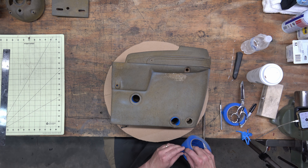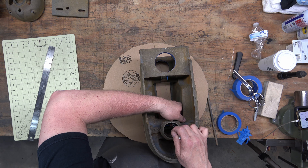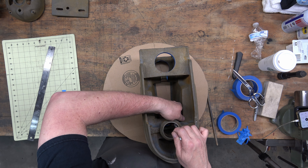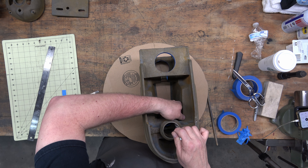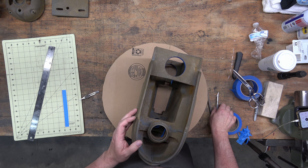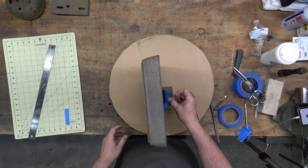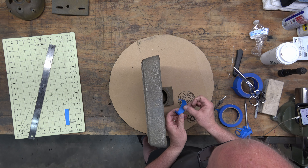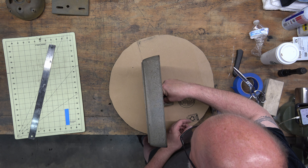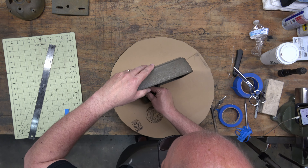I'm going to be painting this drill press with two different colors. After we shoot the first color, I'm going to come back and paint the second color, but we're going to have to do some masking in between. Typically when I paint something, we prime it and then we paint it, and I'll let that paint dry for about an hour, maybe two hours depending on humidity. Then I come back and remove the masking, and then let that unit continue to cure for the next day or two.